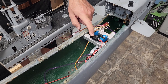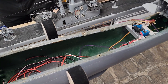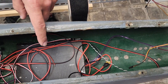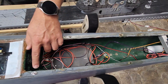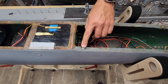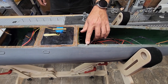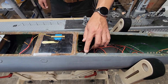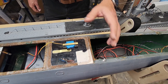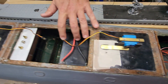Moving towards the back — this is all stuff you've kind of seen before. We've got the mounting plate for the electronics compartment, which I'll show you in a moment. This is the fill port for the pneumatic system — you basically hook up the little pump and give it some pumps. It likes to work at or above 40 psi, but the system is rated to well over 100 psi, so you'll get lots of cycles.